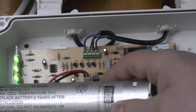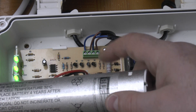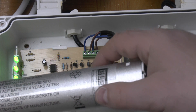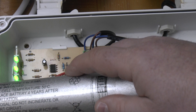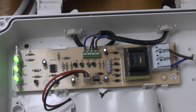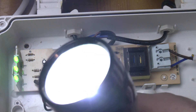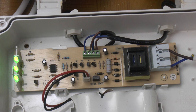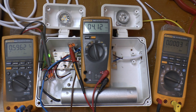For this I'm going to use a different battery pack — still a 3.6-volt NiCad pack, but without any duff cells. Incidentally, these packs are marked up as needing to be replaced every four years, and chances are the cells are still pretty good after that time. So if you've got a battery charger and a D-cell Maglite with an LED bulb, they're perfect — just make sure you leave enough of the solder tag on the positive end of each cell so they can make good contact inside the torch. Okay, we have battery voltage, lamp voltage, lamp current. The voltage drop here is because it's running through the lamp-OK LED.